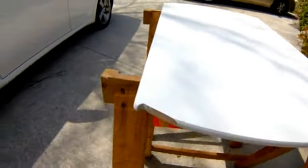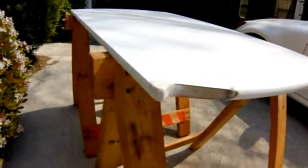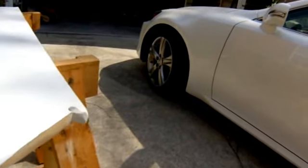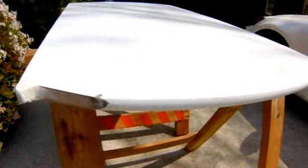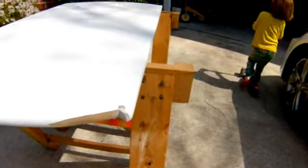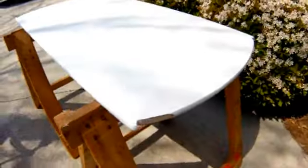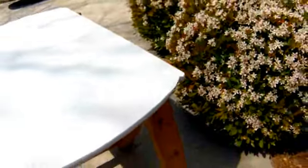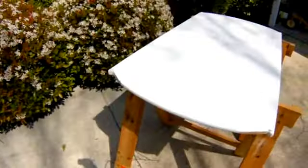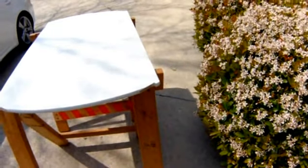When cutting these out, trace your lines and get your cut marks where you think they should be. You can make smaller cuts than you need to at first — get your rough cuts drawn out in pencil. If you're apprehensive about the project, make smaller cuts than you need to, especially at the corners. You can always come back with a jigsaw and make larger cuts later until it fits like a glove. The rest will be handled by the sander, which is coming up very shortly.